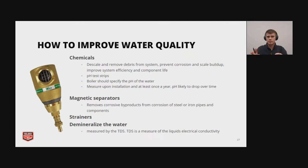Tom? When it comes to oil, if it's a sleeve bearing assembly, usually the oil is done pre-heat season. And then about halfway through your heating season, you check it again. And that's for heating only, obviously. This isn't for a pump that runs 365 days a year.